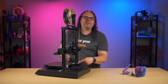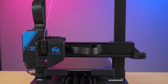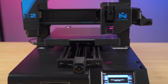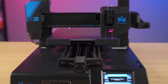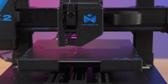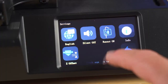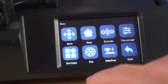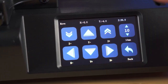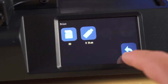There's also optical homing: when the gantry comes down it homes on both sides and evens out the X-gantry if it's lopsided. Another feature is Mingda's 16-point auto bed leveling — they call it self-developed; I'm not sure exactly what that means, but it works fast, works well, and you can trigger it with one touch through the screen. Speaking of which, it does come with a touch screen that was responsive, well laid out, and pretty easy to use — one of the better touch screens I've seen on a 3D printer.